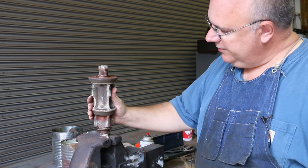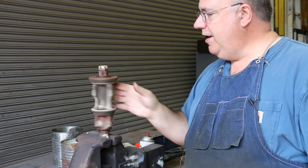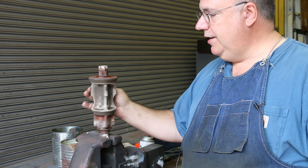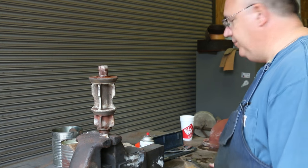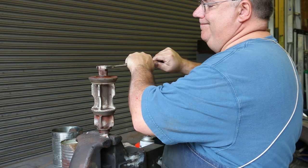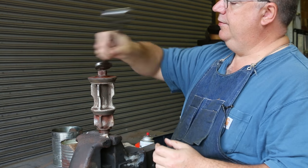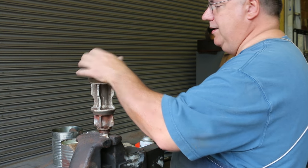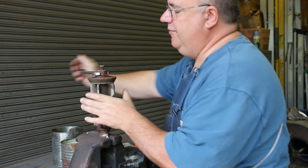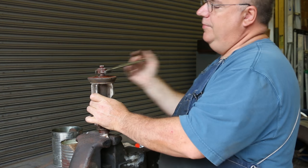I've got this mounted up in the vise. As you can see, we've got the little stem that goes through here that the linkage connects to, and the actual valve just rotates on that. It's fairly tight — there's not a lot of play in there, but it does allow this to rotate around. I want to take this off the stem. There's a couple of bolts up here. I'm going to take this completely off so that we can see about getting this thing mounted in the lathe. I've got a couple of ideas on how we're going to go about it, but until I get this thing off and really look at how it's all put together, I may have to change my plan.